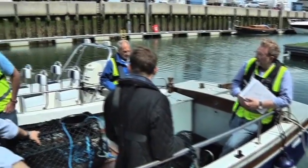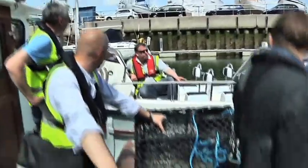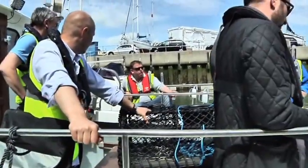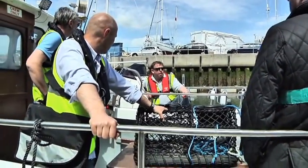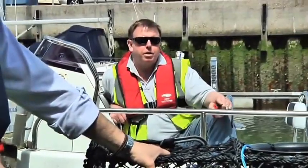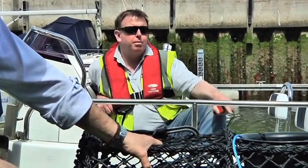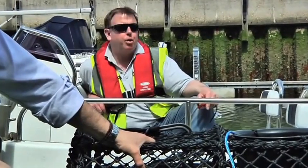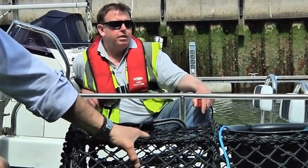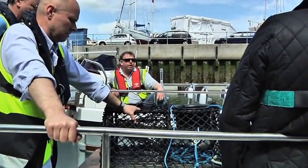Just while you're on that though, on a decked vessel like that with scuppers, a lot of people don't realise that they measure to the top of the bulwarks. They don't measure to the scuppers, and you need to measure to the scupper, because that is, or whatever is, the lowest down flooding point. Do we all understand what a down flooding point is?